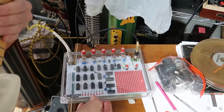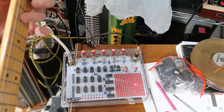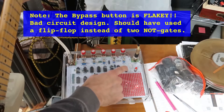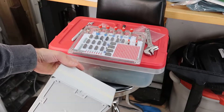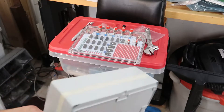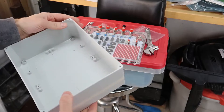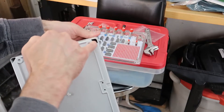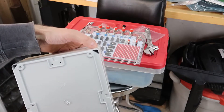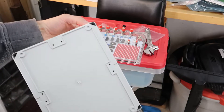It's pretty cool once you play around with it, and you can bypass. This thing is easily under an inch high. So I've gone ahead and marked with an X-Acto blade one inch from the bottom of the case all the way around, then put some masking tape on it. I'll cut on the south side of that all the way around, and then we'll have a nice low case for the top to snap into. The only trick here is that these tapped holes do not go all the way through - it's actually hollow on the other side, so we'll have to backfill this with some kind of clay or epoxy in order to hold those screws down.